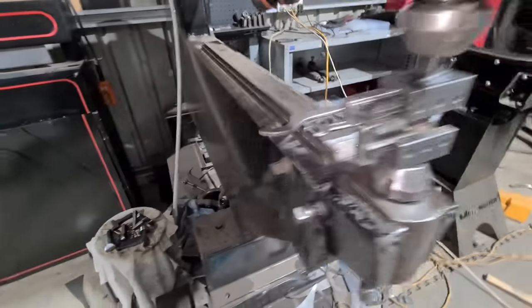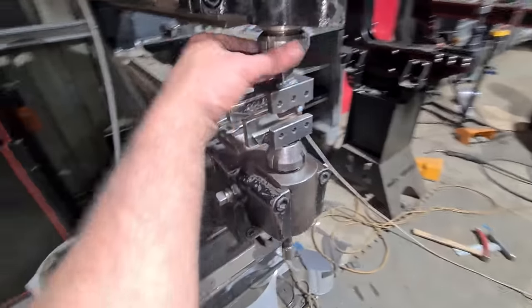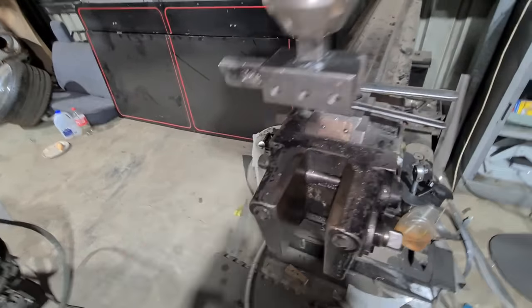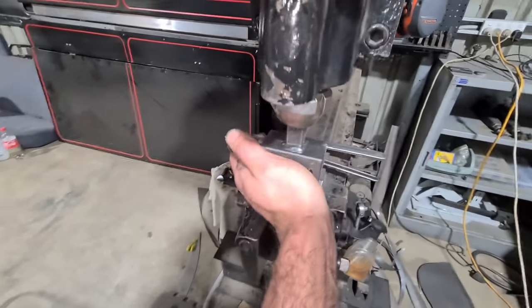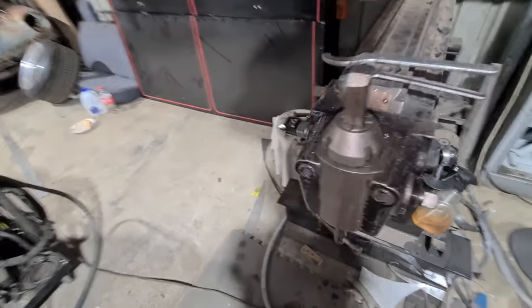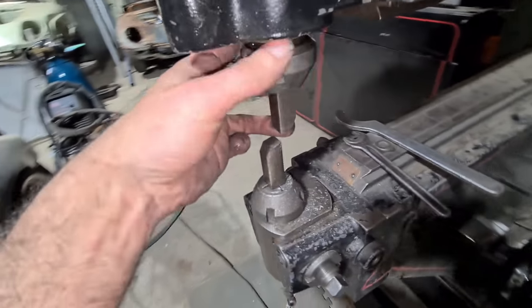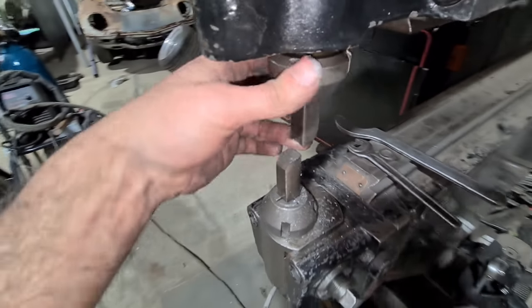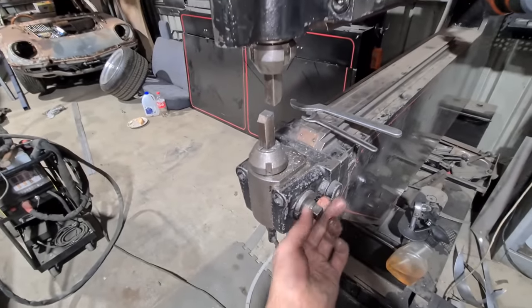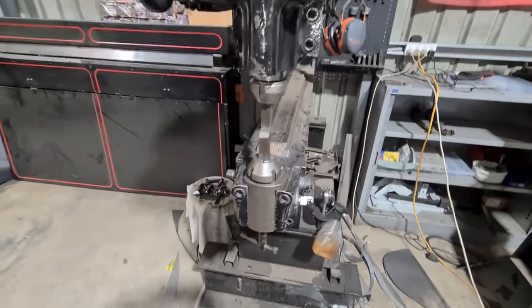Changing tooling is so easy on this machine. I've got an offset lower bottom permanently set up for the shears. I just crack the top gland nut off, crack the bottom — that comes out and you drop the tool on the ground if you're not careful. Just slip the shears in, put the top in, tighten it up. It's already set up distance-wise so it's just ready to chuck the shears in whenever you want to cut a round shape.